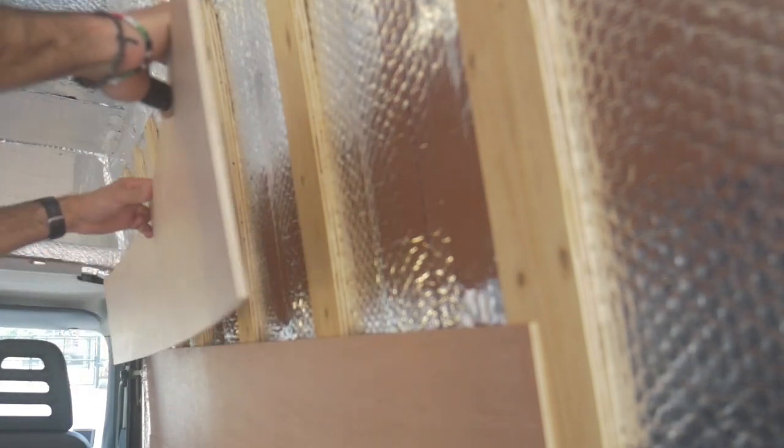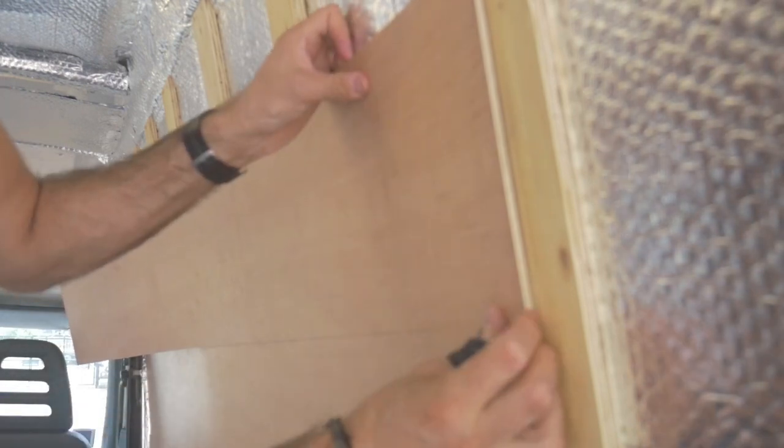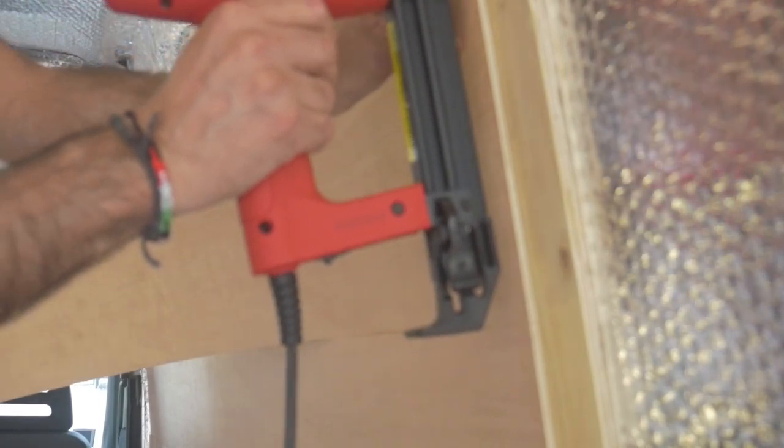I went from the front to the back — a full length of 2440mm, or 2m 44cm, which is what the lengths of the ply come in. I ripped those into the 25cm widths and then cut down to finish towards the end of the door. On the other side, the cargo side, I did the same, but I think I did it slightly differently so the seam disappears behind the actual wardrobe. It wasn't quite a full 2440 — I had to do a small joinery piece at the end where short bits are joined together.